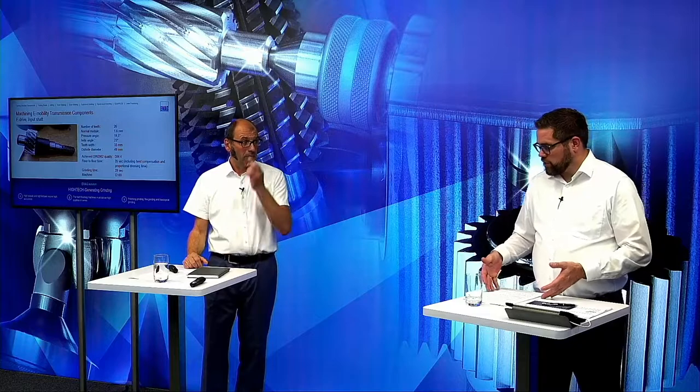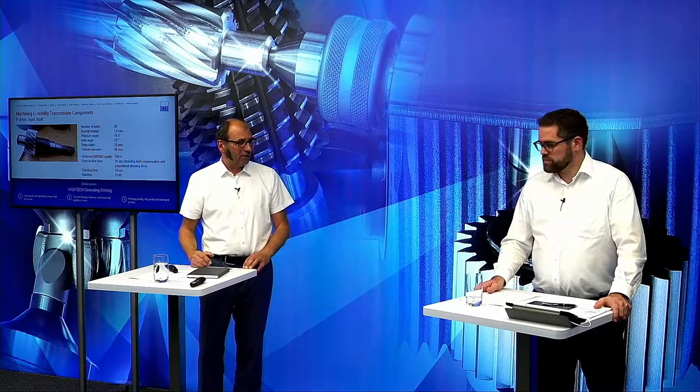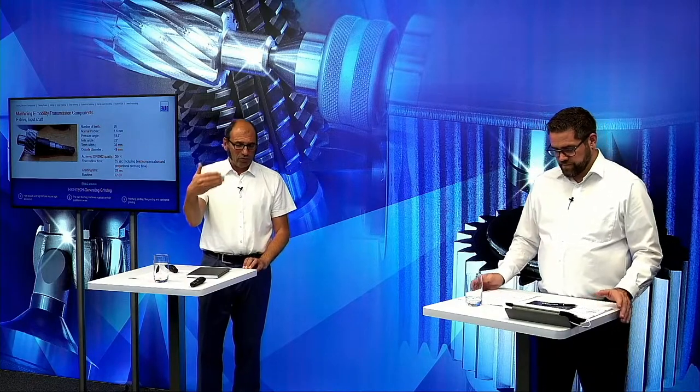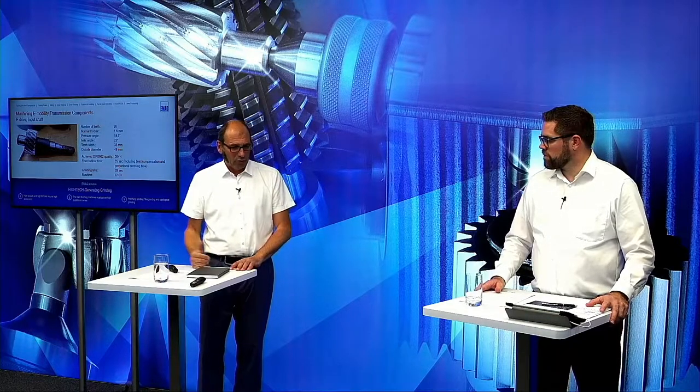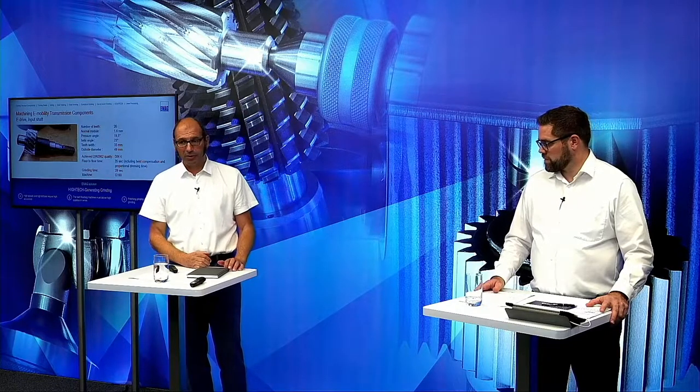But in general, our grinding spindles, for normal threaded wheel grinding, all have an automatic balancing unit. Yes, of course, integrated. It's absolutely necessary for this project, because when you stop the machine, the oil goes down in the grinding wheel, and when you start again, you must balance this wheel again. When you didn't do this, you have some remarks on the surface, which looks like a ghost frequency. So this is absolutely mandatory, to have a balancing system in these machines.